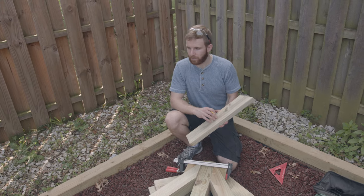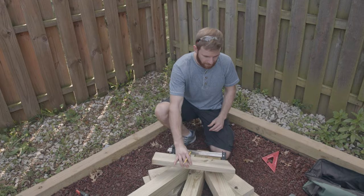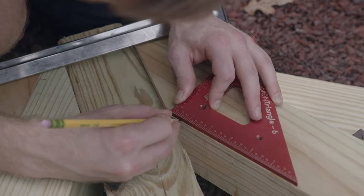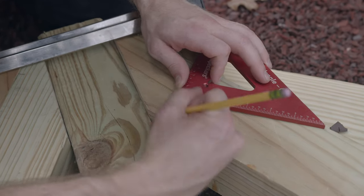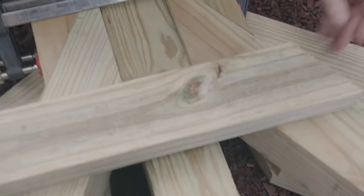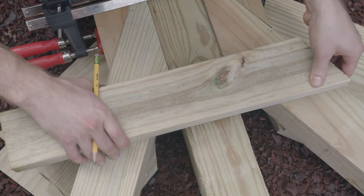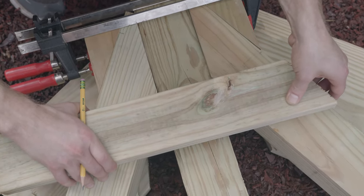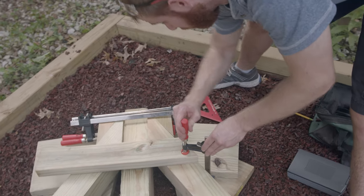So this is the 2x4 that we cut off from our A-frame at the bottom and we're going to use it at the top. We have to measure 5/8ths from the end of our 60 degree angle cut. Now that you have that line, you can go ahead and take your 2x4 and then position it on top of those lines and you'll have your position of your other 2x4. And obviously you just want that angle flush with the angle of the 4x4.